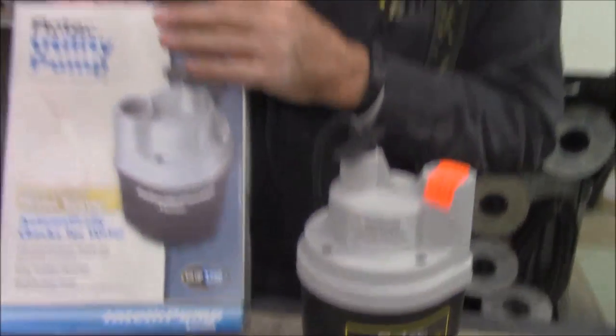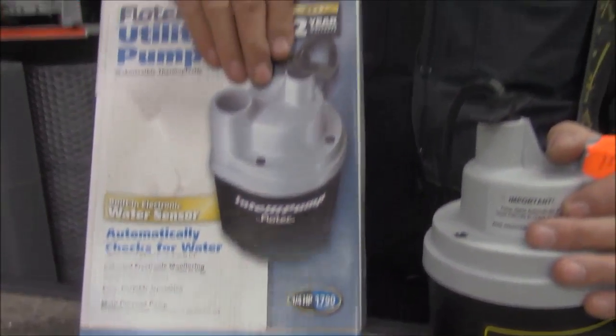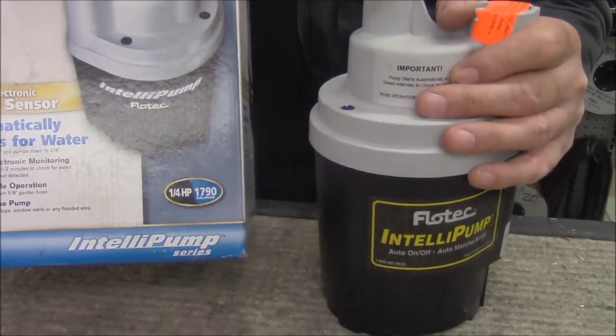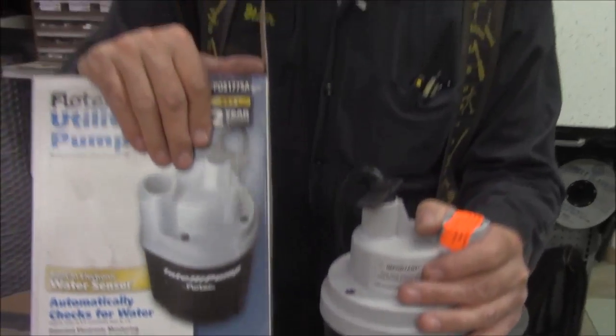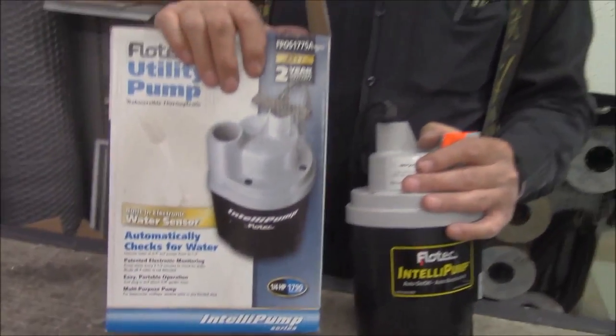Water backup or electric backup pumps should be plumbed out separately, not tied in with your 110-volt systems. This pump will kick on in as little as three-quarters of an inch of water and pump down to a quarter inch — automatically. The only problem is it checks for water every two and a half minutes. When plugged in, every two and a half minutes it kicks on, checks for water, has no load, says no water here, and turns off. It's a little bit crazy — it does run every two and a half minutes for five seconds, so I don't know if I'm in love with this pump as a permanent backup. But this pump is going to be terrific for those of you with a slab utility room or back slab where water's getting in and the slab is so low you can't do much about it — it may be just the ticket to keep that back porch dry. It's a little expensive — over $150 — but it does the job.